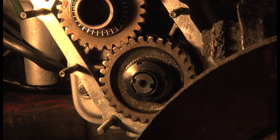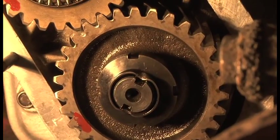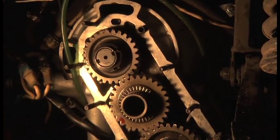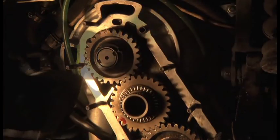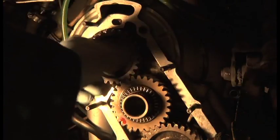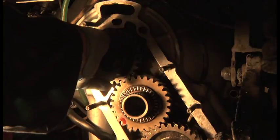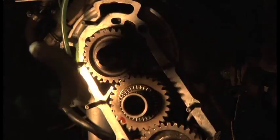Right, now the other side. Okay, there's the bottom one all peened over. Now, that's all done, but I don't know if you folks remember, the top one was loose, even though the thing that saved it from coming undone was, in fact, these tabs. And in fact, this was so loose, look, when I drifted the tabs away, it actually can just come undone with your fingers. Look at that, that's shocking, isn't it? But I think that is a torque related thing. I don't think anyone's had that off, because that nut is intact.